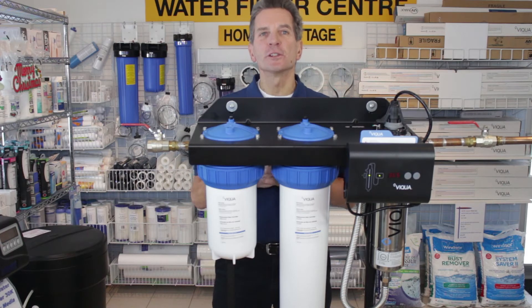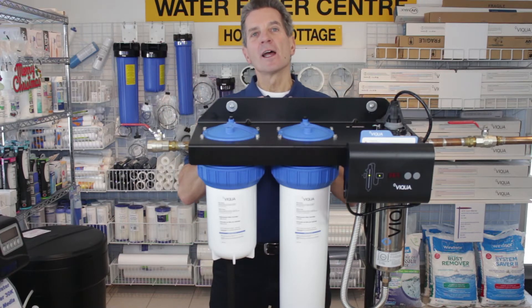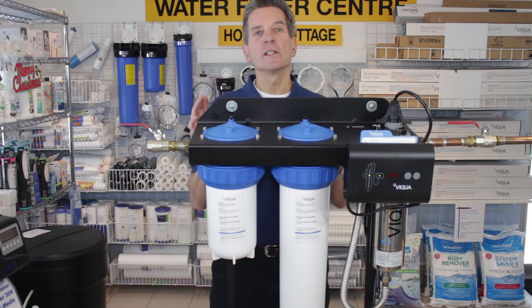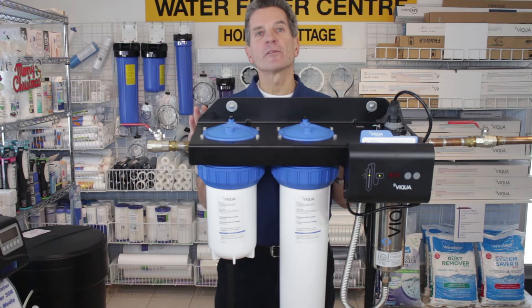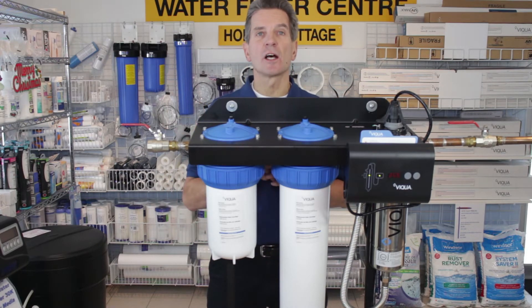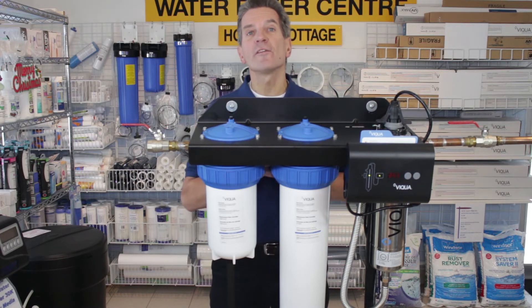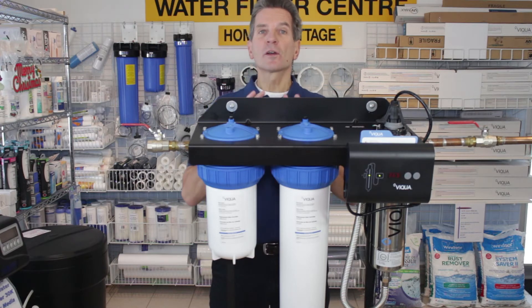These are also very great for do-it-yourselfers, and they're available in three sizes. The IHS 12 D4 is good for 7 to 10 gallons per minute flow rate. The IHS 22 D4 is also good for 7 to 10 gallons per minute but gives more capacity in the sediment filter so you don't have to change it as often. And the IHS 22 E4 is the larger unit, good for 16 to 25 gallons per minute flow rate — so it covers a broad range of applications.